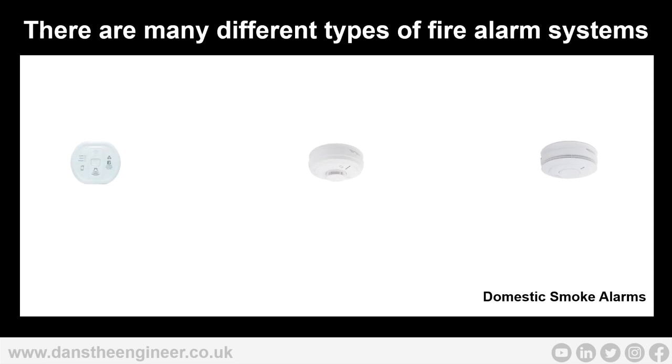It's important to mention domestic smoke alarms. Part 1 of BS 5839 is for commercial fire alarm systems, and I see some people try and install domestic smoke alarms in commercial settings. Will it detect smoke? Of course it will. However, Part 1 doesn't really cater for these types of alarms — as good as they are, they're not necessarily suitable. If you're doing a variation from the standards, you need to be able to justify that decision. Some domestic alarms can be radio with little radio modules, interlinked, hardwired, and these days fancy gateways talk to the cloud. But it is a different kind of fish.